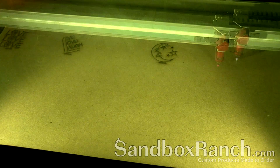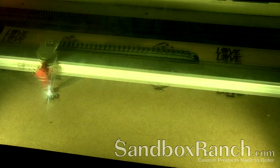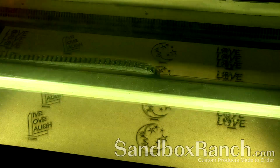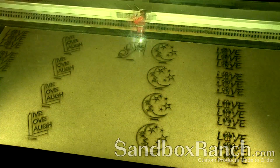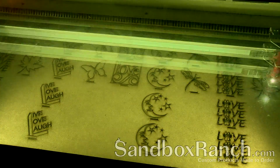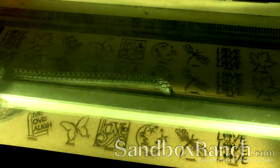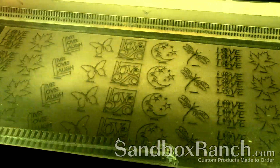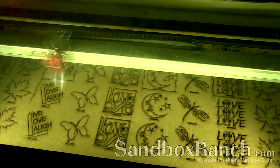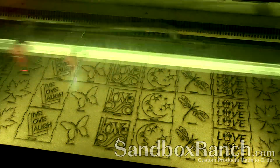You'll notice during the production of these tea light boxes that I'm always doing the inside part before the outside part. The reason for that is pretty straightforward, because if I cut the outside part, it might shift maybe a 1/16, it's not really out of tolerance for this at all, but it's just a habit that I have. So you don't want things moving unless they have to. So what that means is you want to keep everything as a full sheet as long as possible, whether I do so with the router, the laser, the plasma, it doesn't matter. So I'm doing the inside parts first, because if those inside parts move, it doesn't really matter, because I've already cut out what I needed to cut out. And then after all of this is done, then I cut out the outside, because that means that the inside will be 100% accurate and the outside will match the inside, because it was only cut from the full sheet at the very final process of making these tea light boxes.